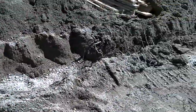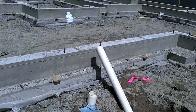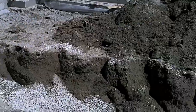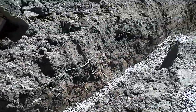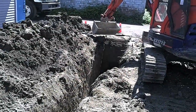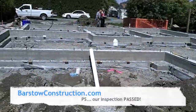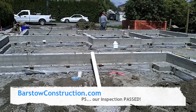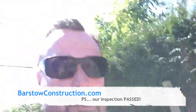What our exterior drainage does is basically bring our sewers to the house. Our plumber is responsible for bringing it from the exterior of the house to the interior — we'll actually go underneath the foundation there and into the house. You can see it's all bedded in gravel, nice and deep, and it ties into the old sewer out the back. So this lot is basically ready to build on once we fill this all back in, and we can start backfilling the forms and the foundation.